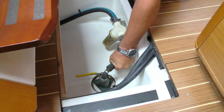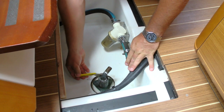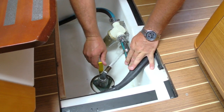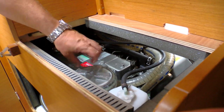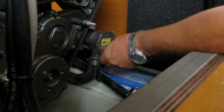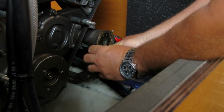Start at the intake, then move forwards. Common culprits will be the intake itself, and some larger weeds can be cleared with the creative use of an air horn. If everything seems clear, there could also be a blockage at the point of entry at the filter. If everything seems clear to the filter, it's time to look upstream — check the impeller.